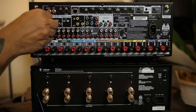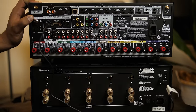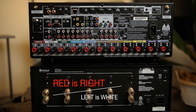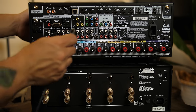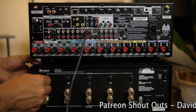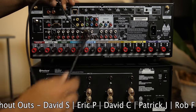First things first, I'll quickly show you how to connect the trigger cable. Now we need to connect the front speakers to the amp. On the back of the Denon, red is right and white is left — easy to remember. Starting with two-channel mode, I'll plug the front left (white RCA jack) into channel one on the Outlaw 5000, and the front right (red RCA jack) into channel two of the amp.